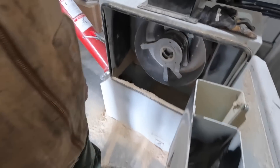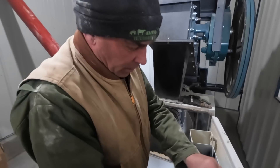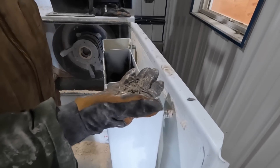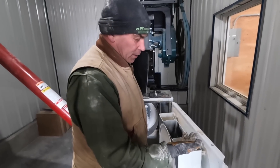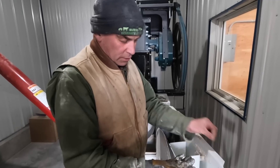You can imagine if a bolt like that tries to get pushed through the screen it just wrecks it completely. But the big thing for cows is if they eat a little sliver like this, it gets in their stomach and cuts through the stomach — they call it hardware disease. That's what can kill them. That's why we give magnets to all the cows as a preventative measure, and this magnet here is one of those preventative things.